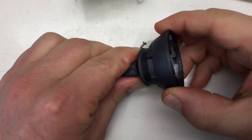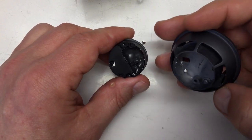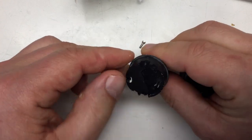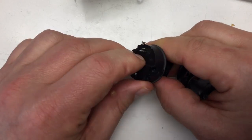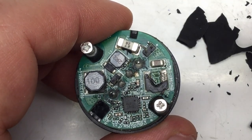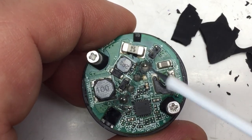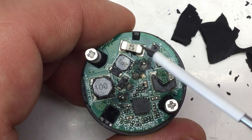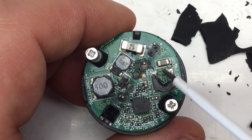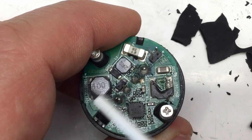You can detach that back here, and this will reveal some potted stuff. But this is a real massive aluminium case. There should be the bridge rectifier inside. I will try to scrape that off — off camera. This is getting crazy. So below that relatively soft and easy-to-cut rubbery material, we find another board. And here we find a big-ass capacitor, lots of inductors — that was an inductor too, I killed it while scraping up the potting material. That's our connector, and on to the next story in this layer cake.